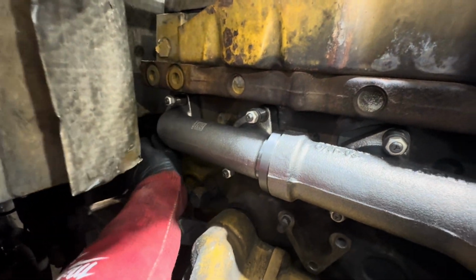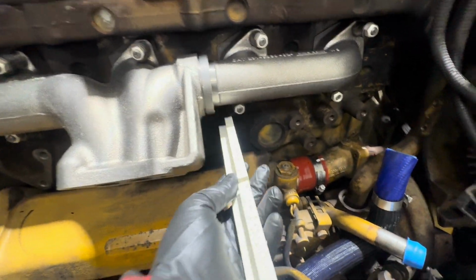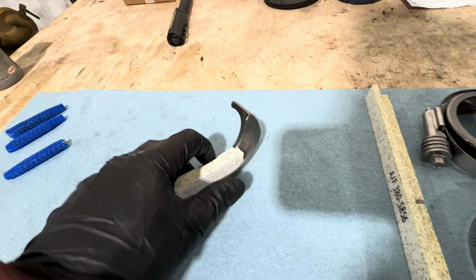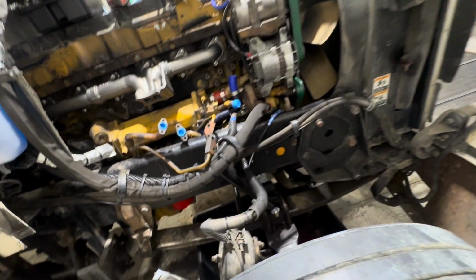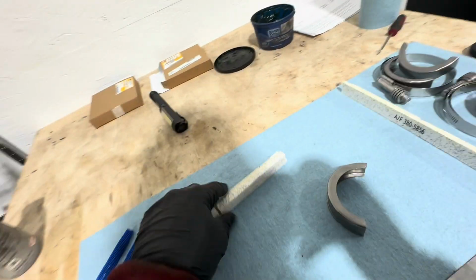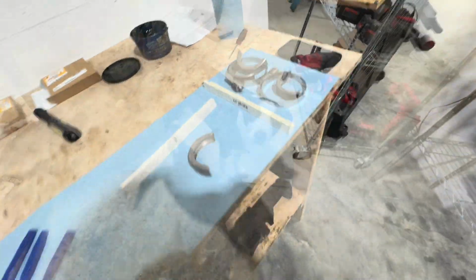All right, well, I'm gonna snug these down. And then we will go ahead and install these. These are the seals here. How they go is kind of like this, and it wraps all the way around it. And then they get sandwiched in place by these. As you can see, it is a perfect fit in there. One side of this is a little bit taller. The taller side goes on the outside, obviously. Come on, like that, and locks everything down in place. So I'm gonna snug all this up. I'm gonna need 2 hands for getting these put in, and then we'll pick up from there.